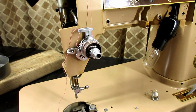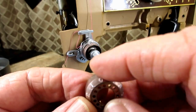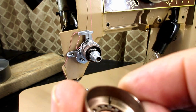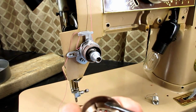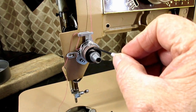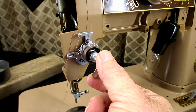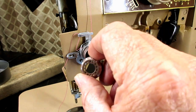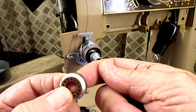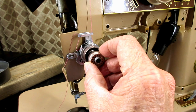I'm satisfied with that. I'm going to leave it there. Now I put on this numerated dial. Behind the zero there is a little protrusion or nub that's built in — I'll call it the stop nub. And that stop washer had a stop finger sticking up. That's to stop the dial when you do one full turn — you don't want to just keep turning left and take it off. So when you put the numerated dial on, the zero with the stop nub behind it has to be on the right side of the stop finger.